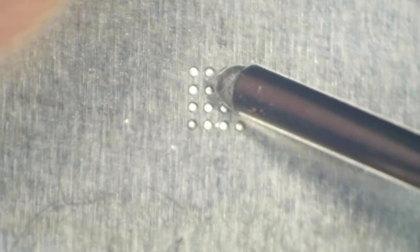Next I needed to change the alloy on my chip. The solder I used to attach the jumpers to the board is leaded solder, but for putting the chip on top of those pads I wanted it to melt just a little bit lower than that. So I'm using low melt solder, which melts significantly lower than leaded solder, but can be a little more tricky to work with when reballing. We're just going to warm this up and form some nice semi-symmetrical balls.